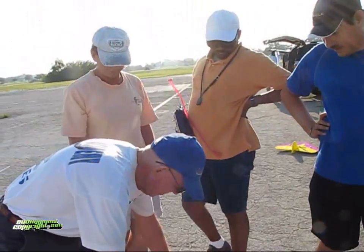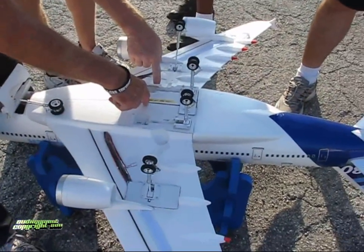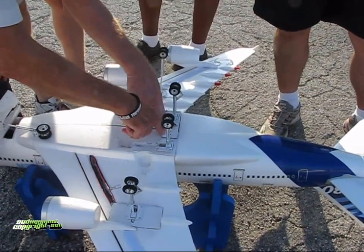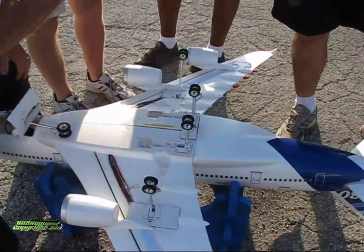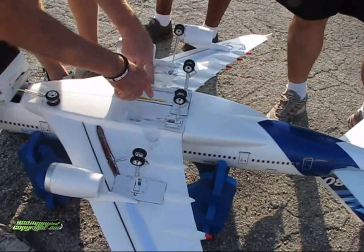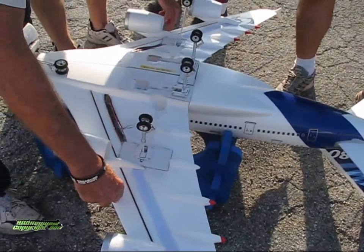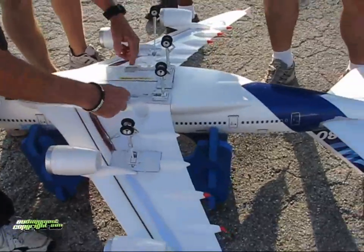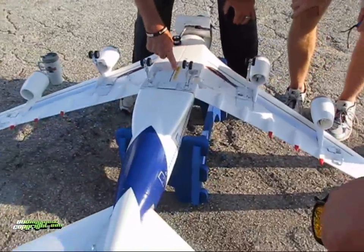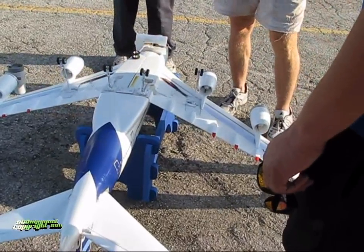I've got the original drawings from Airbus, so I'm thinking it should be right. Well then it's really tail heavy and I'm gonna have to move the main. This is the calculator — that's what I would do. This is from Aviation Week and that's what I got from Airbus. As you project this out this way, 25% of the wing area. A swept wing is a little bit different, but that's what the calculator is for. I would guess it would be somewhere in that neighborhood.